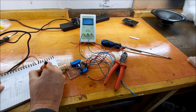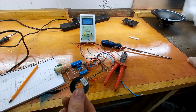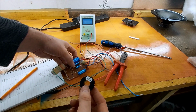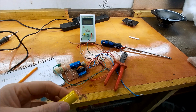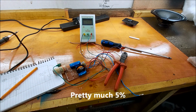Right, okay. Might have something for that. Right, yeah, I got a couple of these air core inductors, 0.23, 0.6 of an ohm, so ever so slightly off on the resistance, but yeah, that'll do. It'll go in there. I would just like to improve those capacitors on the tweeter circuit. I have some 4.7 polys, which is near enough to the 5, but the 3.3 is the problem.